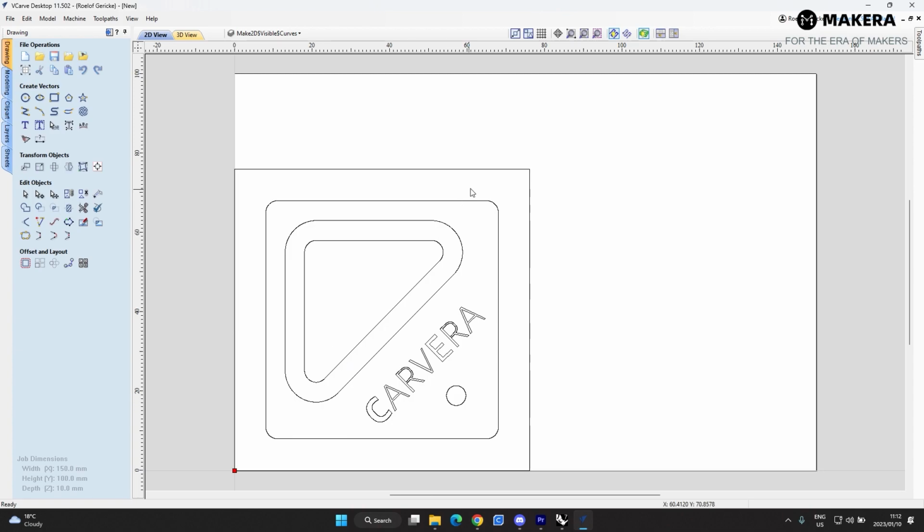Some people will import only the part, and then the XY location would be over here, or manually you move this part to an offset position, but then still export the XY point as this point. So there's lots of different ways to handle offsets. For me, I like to import it with a borderline, which is the offset, so I know, and then I don't touch this, I don't program anything on this line, I just know it's only there to create an offset of my part, to create space for the bits and the clampings.